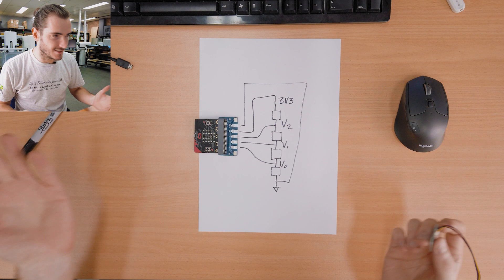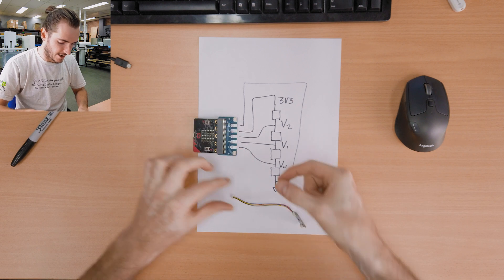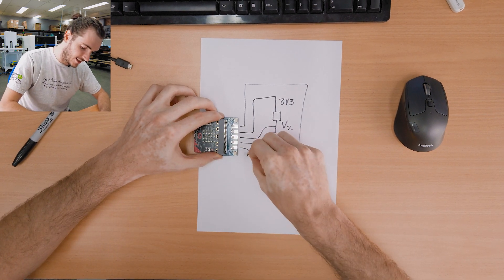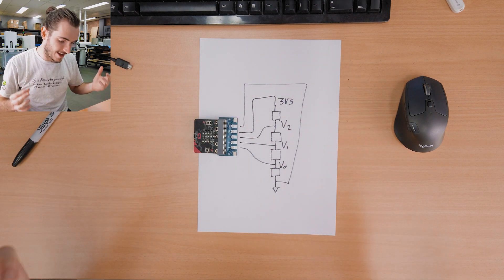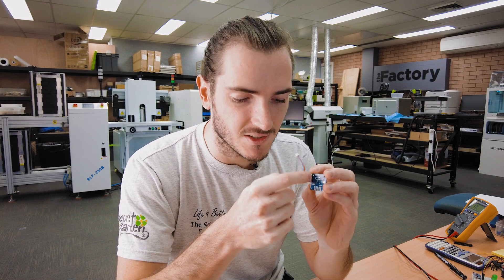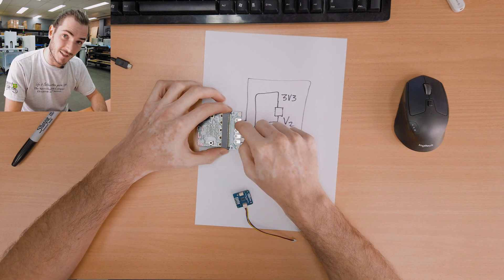That takes care of the GPIO parts of the breakout, but for the PicoDev connectors it could be as easy as having two different temperature sensors built onto the jig, each with their addresses set differently. As you plug the jig on, you'd have card edge connectors connecting to each of the GPIO, and aligning on the jig a PicoDev connector to plug in and out of both spots. If I remove the I2C pull-up resistors on the jig module by cutting a jumper, we can make sure the pull-up resistors on the adapter have been placed properly — if we can read the device, they must be working.